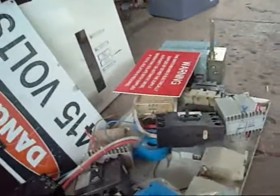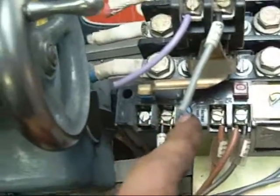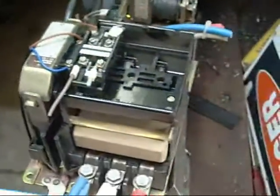Thanks for watching. I've got power hooked up to this contactor coil - I'll just show you how it operates. This here is the thermal overload. I think that's an automatic reset solenoid, so if it overheats or over-amps and trips this out, this will reset. There's a timed automatic reset - that will pop in and reset it and restart the motor again. And of course it has safety systems to prevent burning the motor out by constantly trying to restart it. The rest of this is the main contactor - makes a good clack when she starts. I'm just controlling that by the panel.